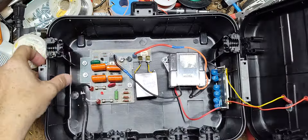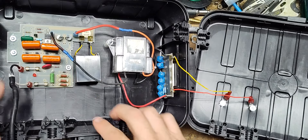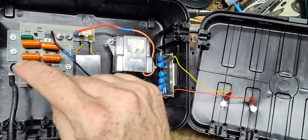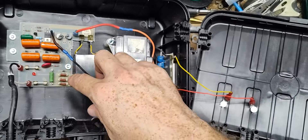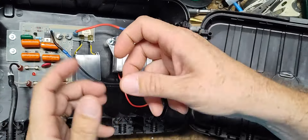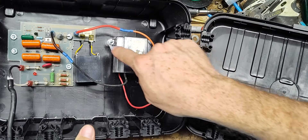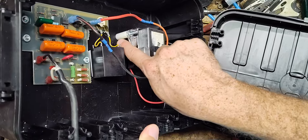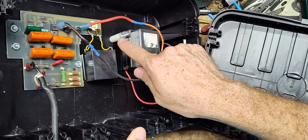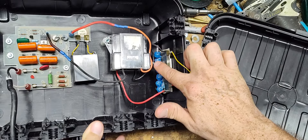Here's the inside of it - pretty basic. This is the circuit board that was in his unit; we pulled it out. I drilled three holes and got nylon spacers - plastic spacers between the board and the shell of the unit to cushion it, so when we're tightening it down we're not tightening hard into the board. Those nylon spacers will absorb some of the pressure. For the transformer, we drilled two holes and put a long bolt in with a spacer in between so it wouldn't tighten down and bend or break that ear off.